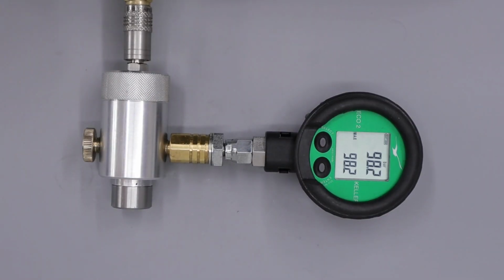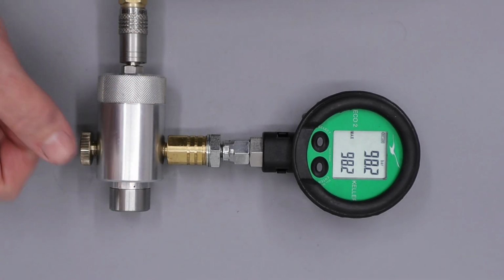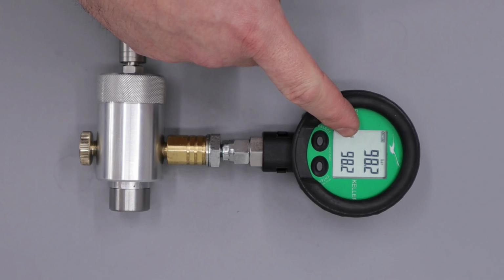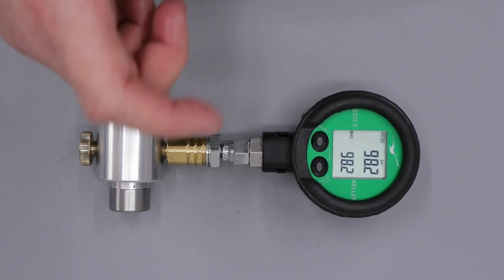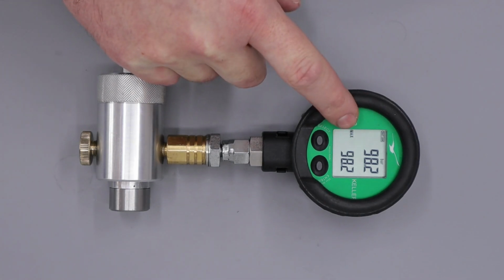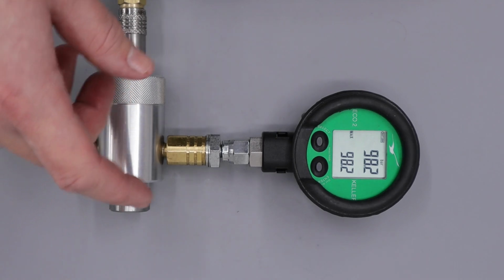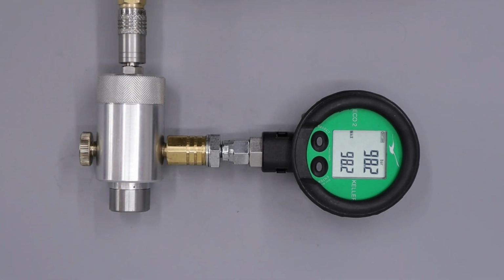And obviously you're probably not going to have a reg tester, so you're going to need to do your testing on the rifle. The Wolverine does have a reg gauge on the side, so you can compare what the regulator is set to now versus what it was before you took it apart. But I'm quite happy with how the regulator is operating, so what we'll do now is I'll take the regulator out again and we'll show you how to adjust the reg set pressure.